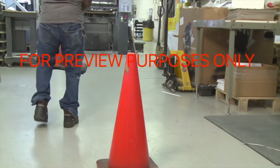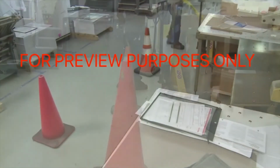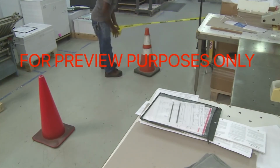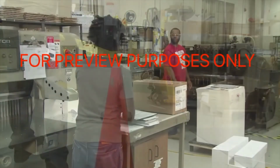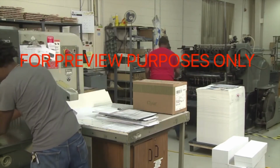You may also need to physically isolate locked out hydraulic and pneumatic machinery to make sure that their moving parts aren't jostled free by passing forklifts or other equipment. Barricades or other devices can be used to help limit this type of traffic. In some cases, you may even need to arrange for the shutdown of nearby machinery.